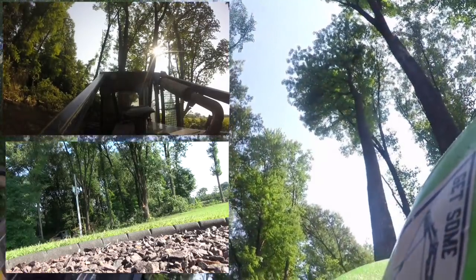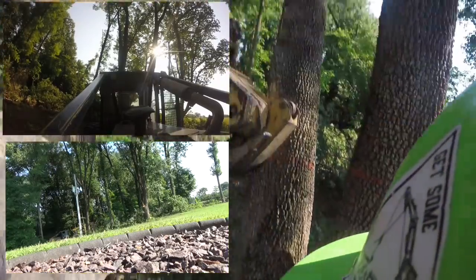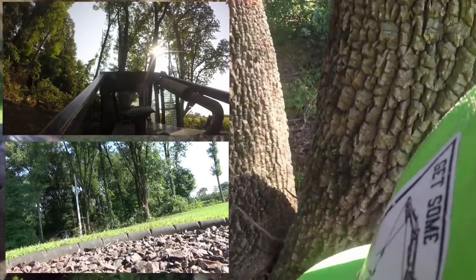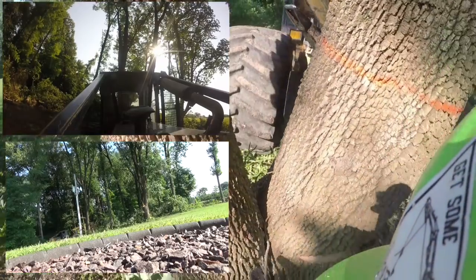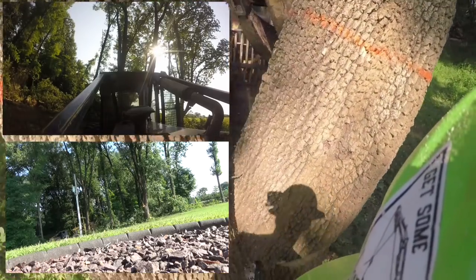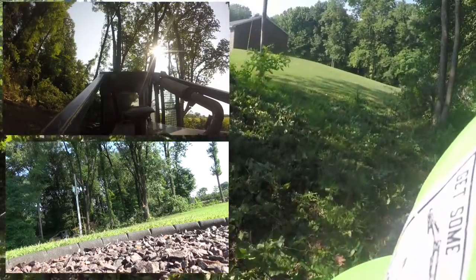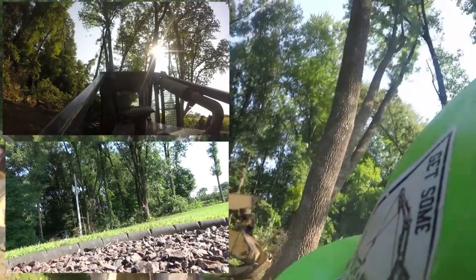I mean, I thought I was going to hit it with the buncher a couple times the other day when I was cutting around. So anyways, here I stood the tree up to where it's leaning away, but here's a peculiar situation we find ourselves in. The way that tree is, it wants to slide up underneath the back of the skidder if I cut it free. And I need to cut a little bit of it so it isn't pulling fibers so bad, and it busts loose easy.